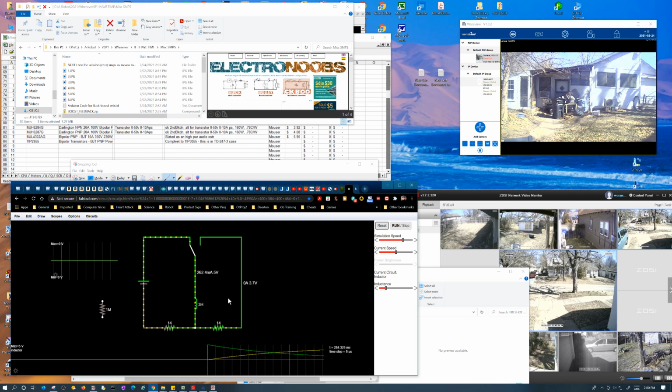It's just like taking a capacitor and increasing it by 10 times; you're putting more energy into it, and that's effectively what you're doing here. It's easy to think that with a capacitor, the smaller the resistor, the quicker it will charge up. That's how capacitors work. But a capacitor stores the same amount of energy if you charge it up to the same voltage, no matter what.